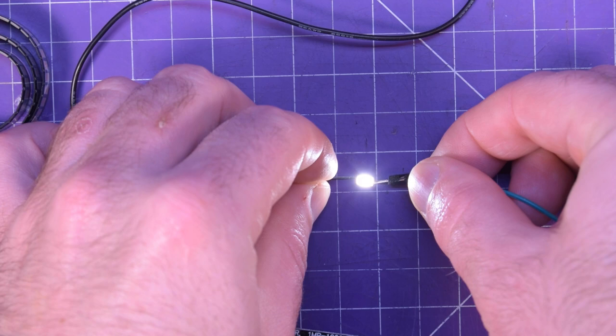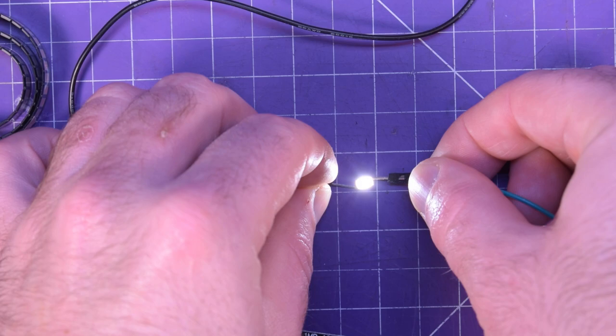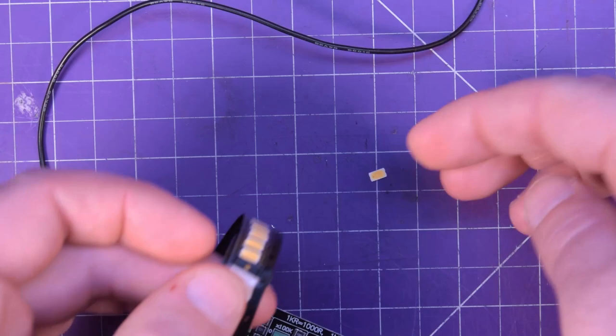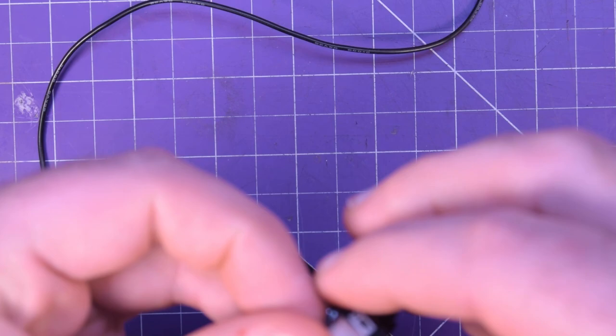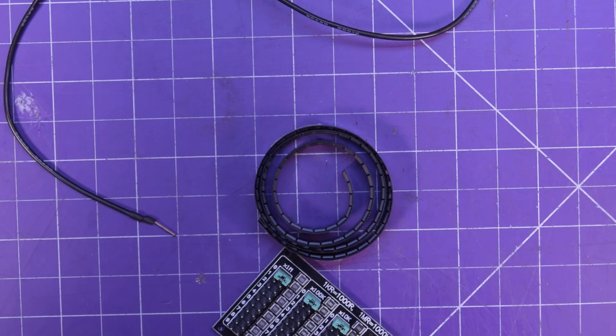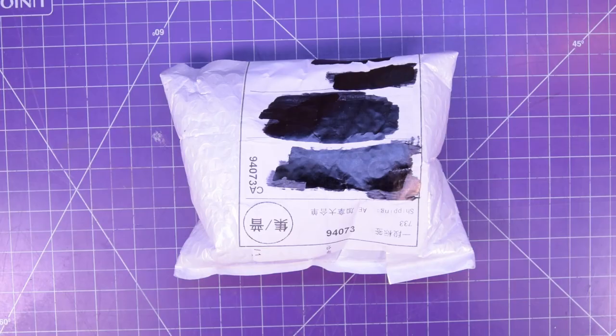That's pretty good right there — that is 10 milliamps, which makes sense. And I think they're quite bright enough. So I'm going to put these in my stock of parts and make a PCB — very likely going to be sponsored, which is great. You guys will be able to use my designs for free. I'm pretty excited about putting this together. We can always adjust the resistor values to adjust for brightness, or adjust the voltage value up to get a little bit more brightness out of them.